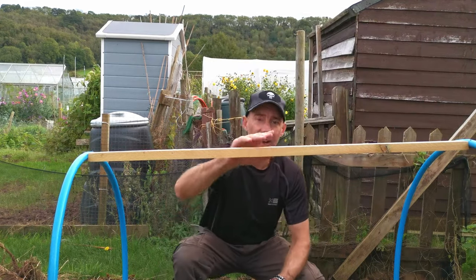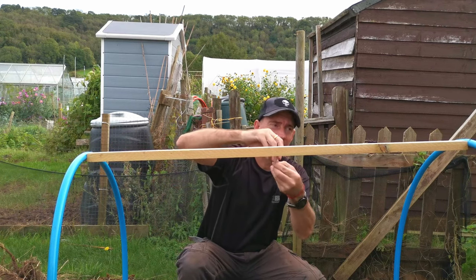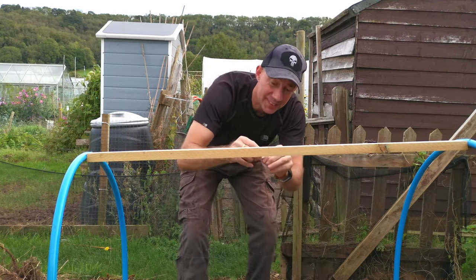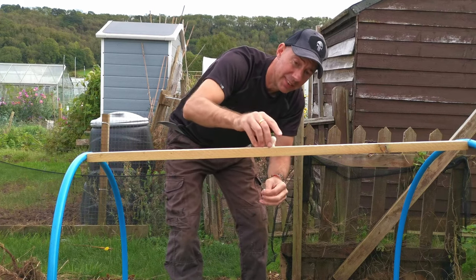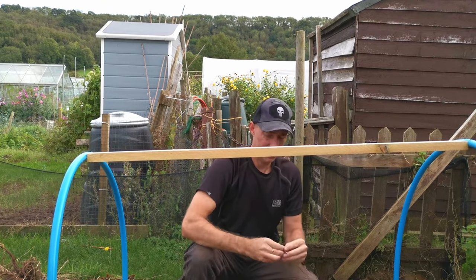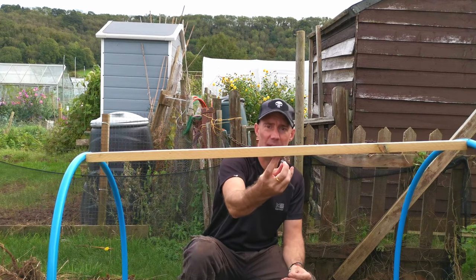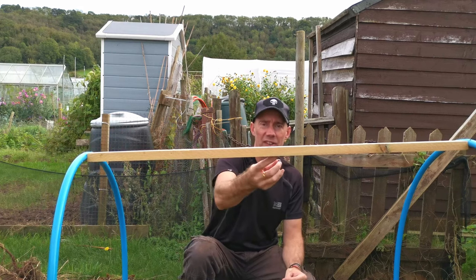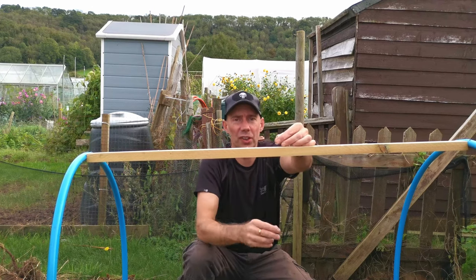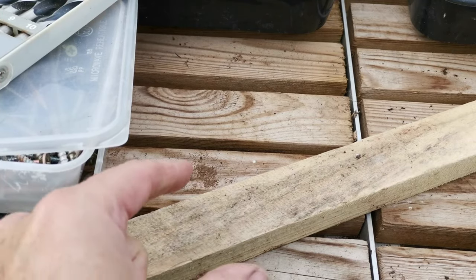So next up, we want to fit the handle to the top. Now I've gone with a simple knob handle. What it is, I'll unscrew it. It'll sit on top like that, and we want to screw from underneath. Okay. Because this wood is thicker than the actual screw, I'll need to put a larger hole in there first, halfway up, and then screw her on. But very important step, drill the hole first and then put this on last. And it will look like this.